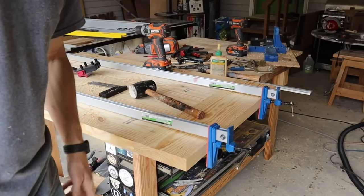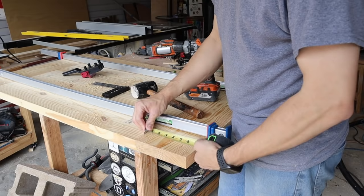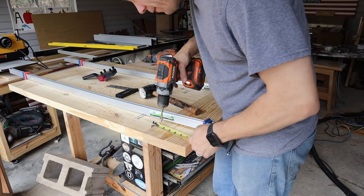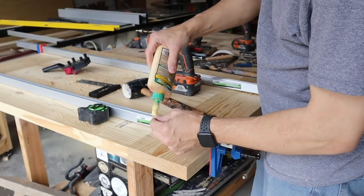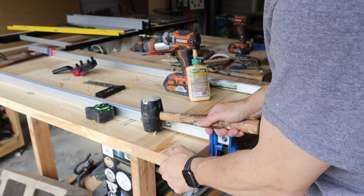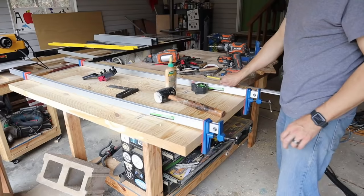The only other thing is we're going to lock these tenons in place by using a quarter-inch bit and quarter-inch dowels — all these dowels come with that doweling kit. I measured out three-quarters of an inch, put it right on that line in the center, and drilled down into that tenon. This locks the tenon in place and keeps it from pulling out. According to Woodward Builds, you put a little glue on top of the pin, not down inside, so that everything still moves if need be. I'll trim that off with a flush trim saw and sand it smooth.